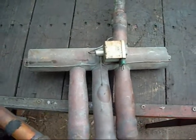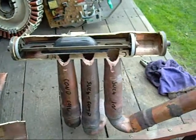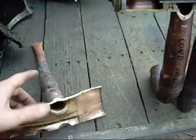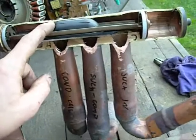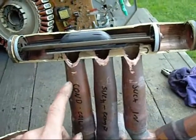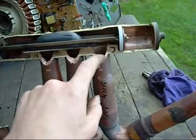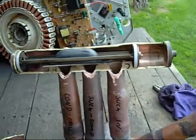In a moment I'll attempt to dissect and dismantle this valve to show just how it works. This is the cutaway of the cycle reversing valve. As you can see, the top section has come off. This is a high pressure, high temperature gas tube from the compressor — the compressor discharge comes straight out through here and into the body. Right now it is in heat mode where the compressor suction is drawing from the condensing coil rather than discharging to it. The suction in from the interior unit is receiving high temperature gas from the compressor, flowing out through the suction line to the interior coil to create heat.